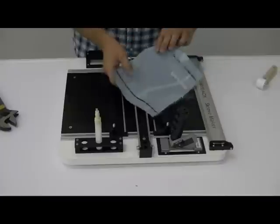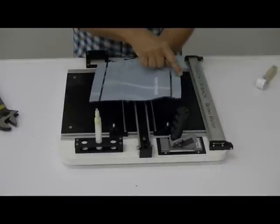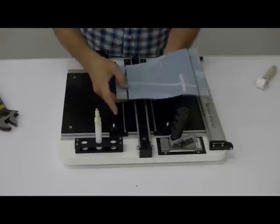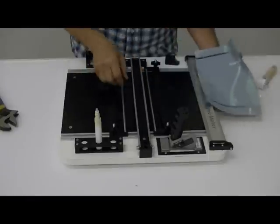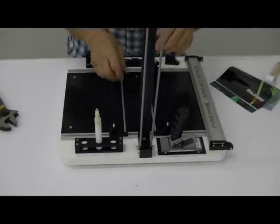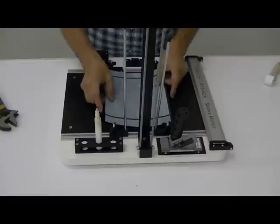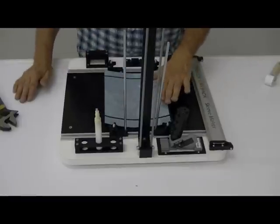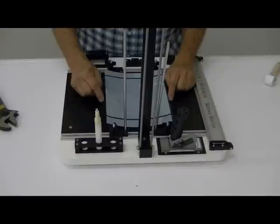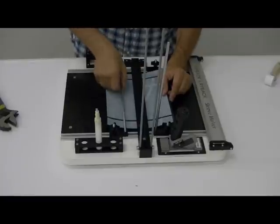Now that I'm ready to make a sample, I'll take my sleeve sample. I want to leave a little extra at the top and the bottom of the sleeve so as I'm applying solvent and cutting it, I have enough to cut a good edge along the edge of the material. I first want to raise the center section, the two clamps, the center unit, and both forming fingers. Now I'm going to position the sample in the machine so my seam area — my five millimeter seam area — is on the left-hand side and my one millimeter is on the right-hand side. Once I have it in the correct orientation, I'm going to lower the center clamp and then the right-hand forming finger.